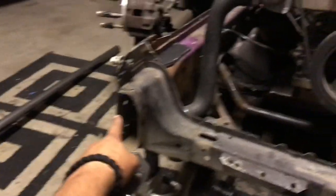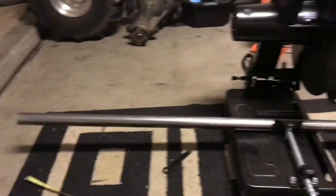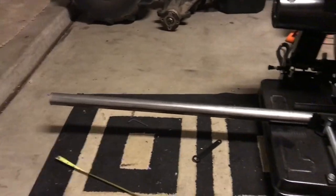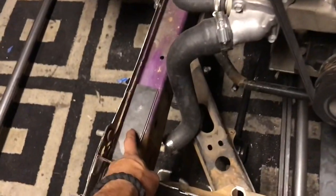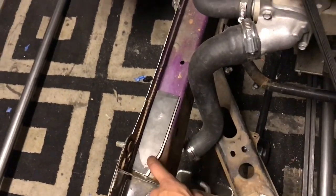The plates are done and your front plates are done. What I'm going to do is cut out three feet of inch-and-a-half by .09 wall thickness tubing. That way I can mock up pretty much where and how long this is going to be, and know where the tube is going to meet on here so I know where to drill my holes out.